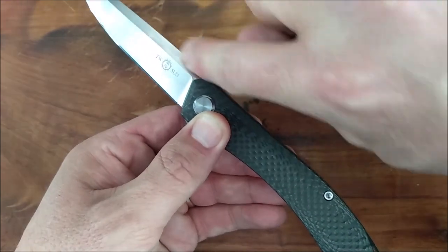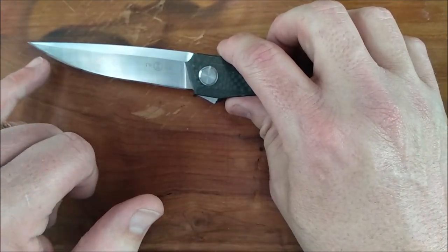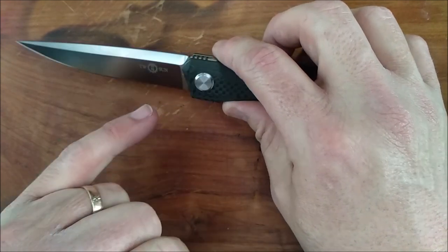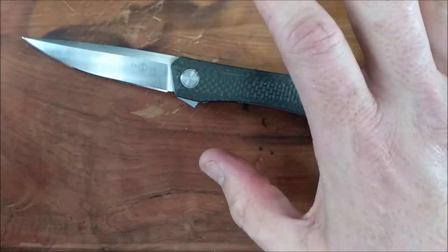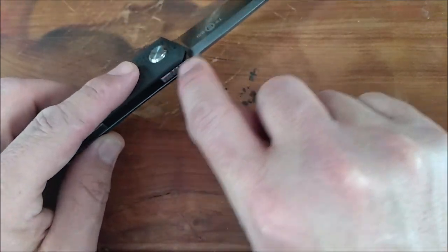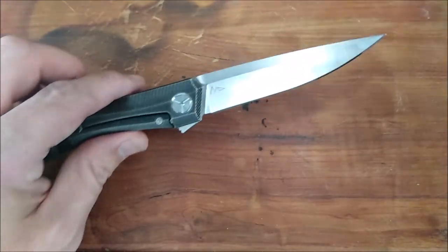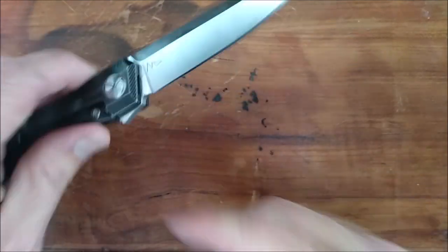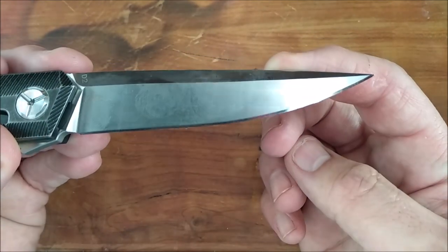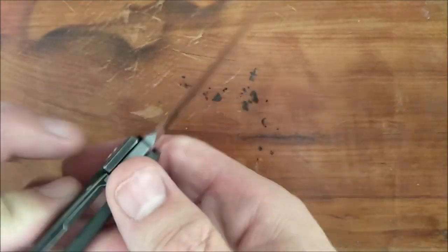If the swedge wasn't here, you'd have a long flat section. So saber grind, very gentle belly, and just a short section here — that's great. Good sharpener's choil, nice plunge right there. This knife is not necessarily the easiest one to sharpen in a clamp system, but I found it easy when I just took it apart and clamped along the flat section on the spine of the blade, and just held another clamp on the steel to keep it from moving. It's sharpened up very, very well. After I sharpened it, it's got a beautiful, nice mirror edge on there — not a perfect mirror edge, I didn't spend that much time on it, but a nice edge.